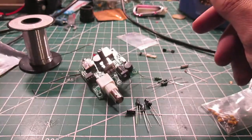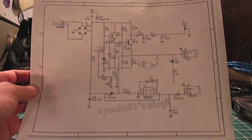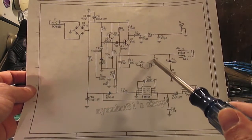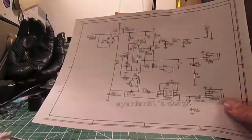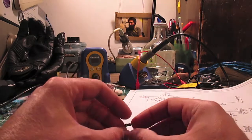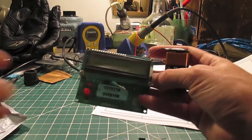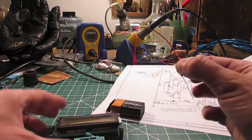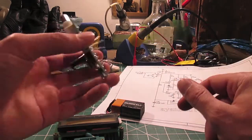I think we're going to have to get the schematic to figure out the rest of this. I found a schematic that may or may not work. The reason I chose this one over the other several schematics is that the bridge rectifier, the jumper, the LM386, and the correct number of inductors all seemed to match the circuit. First thing we'll do is start identifying some of these components — these are the inductors.